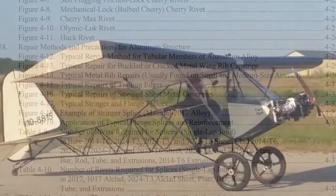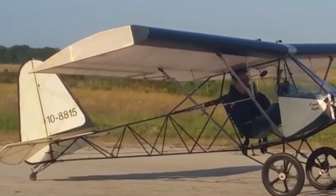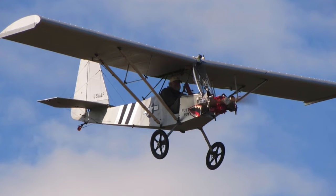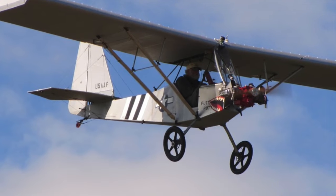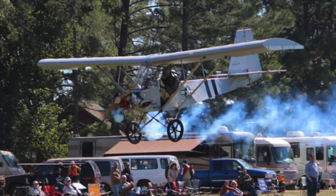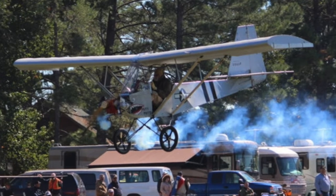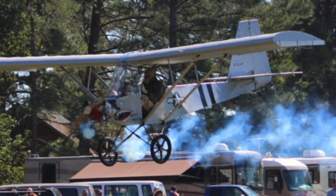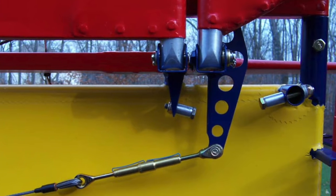As many of you know, the legal eagle tail is the most modified part of our aircraft. There are many that rounded the edges to appear more like a cub's tail, and I believe it was Joe Spencer's Putt-Putt where he clipped the tail in order to fit it in a standard trailer. Whoever it was stated he didn't notice any differences in performance once it was clipped. Since most of you know my plans were always to fold my wings, I wanted to narrow up the width of my horizontal feathers without losing any surface area so it can go inside a trailer or toy hauler. My plan is to not fold my tail if possible, to help save weight and speed up the takedown and reassemble times. I do have a backup plan if I need to fold them, because I'd much rather fold them than have to remove them totally.